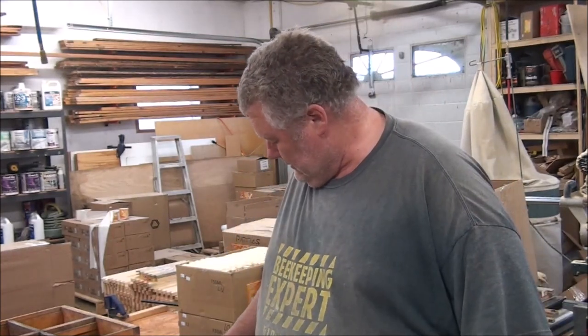If you're doing any woodworking and you don't have feather boards, this yellow thing here that's guiding it in, you don't have featherboards, they're not very expensive. You can actually build them if you want, but I think the ones you buy, they're not expensive enough to bother. And they work really well. Get some featherboards. This is a Milescraft featherboard. It's a good featherboard, but you can also get, I don't know the brand name, the ones that have magnets, Maglocks. Maglock might be the brand, I don't know. And it magnets down to the table.